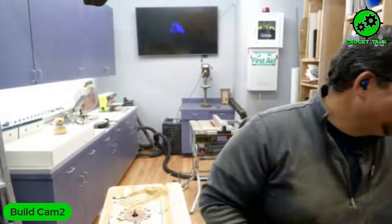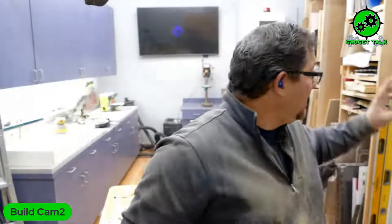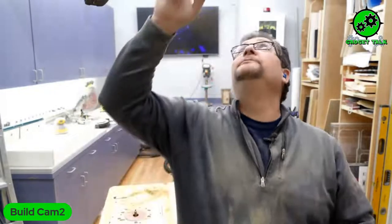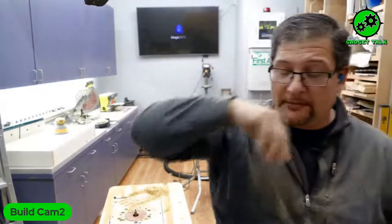And there's Chad cleaning the lens. It's dusty. So I can see it all over your pullover too, Emmett. And honestly, when you cut MDF, you should wear a mask. Mine's over at my paint booth. I should have put it on. This stuff is actually bad. I don't know if it still has arsenic in it, but it may. So anyways, it's always recommended, because these dust particles are small enough, which is why I have a micro dust collector up here. That will suck all the small stuff up into a filter, but not this much. But anyways, it's not good to breathe if you can prevent it.